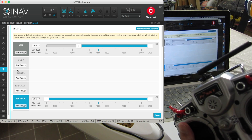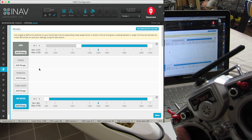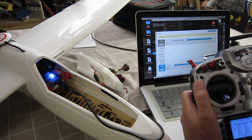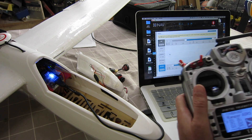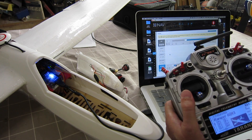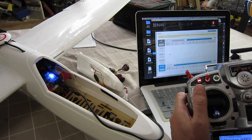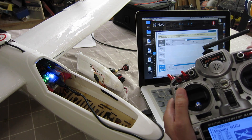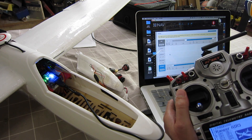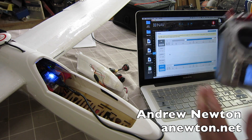I don't like angle and horizon modes at all — I was never able to get the plane flying level in those modes. Why not just let the GPS take care of it? You don't need to level out your board perfectly. My workflow is: launch, put it into altitude hold, then loiter mode to adjust my goggles and check FPV, go for a flight, trek off holding altitude, revert to manual mode if needed, and bring it home. If it goes out of range, failsafe takes care of it. That's the way I like my iNav setup — thanks for watching.